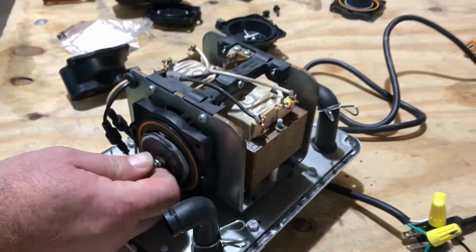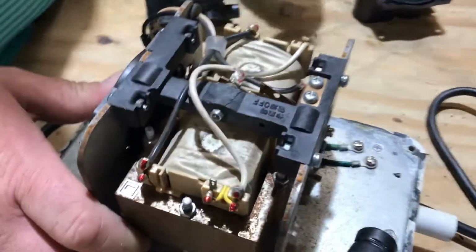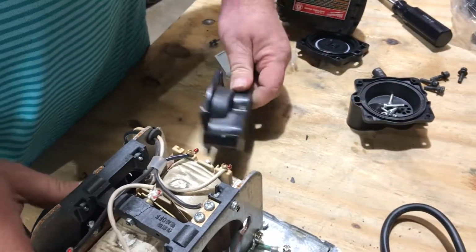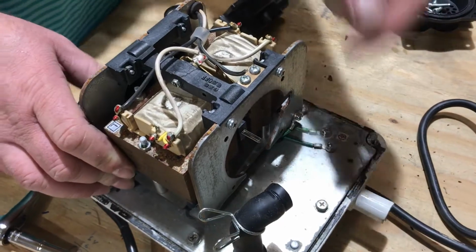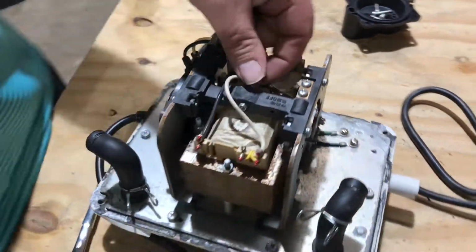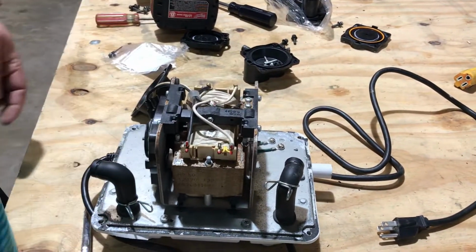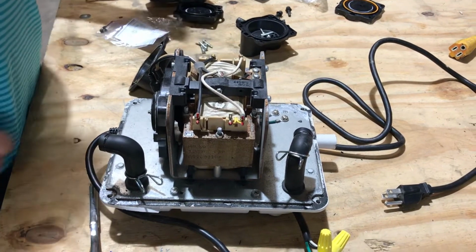The reason it shuts off is this magnet here travels back and forth, and if it doesn't shut off, it'll start hitting this chamber block right here, and you can actually crack the magnet, break the threads, and strip them out. It'll rub back and forth. We've seen it where people take a zip tie and put that in there, and then when they go to rebuild it, their compressor's ruined. So you don't want to do that.